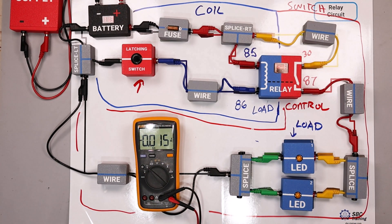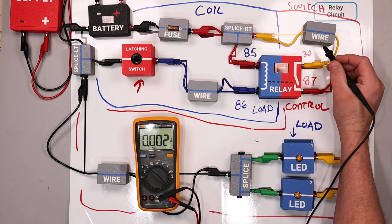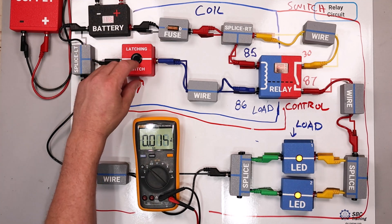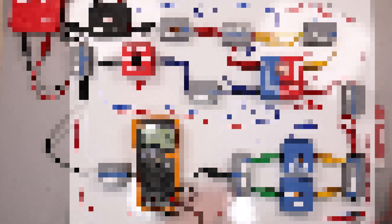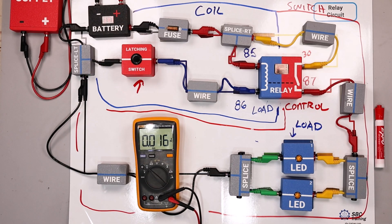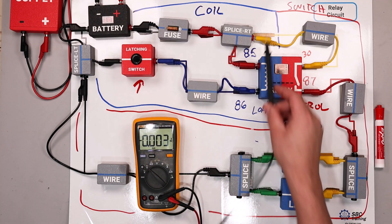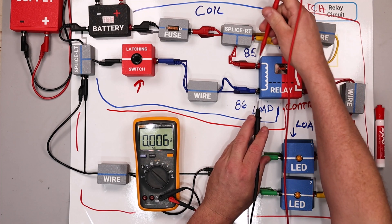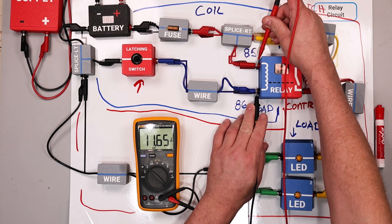For training purposes, that took about 10 seconds to fix. I kept everything running live so you could see how quickly you can set faults and take faults away. Pressing my switch now, I should see correct illumination of the LEDs. I'm turning off the camera so you don't know about the fault prior to testing. Trying to turn that on, we don't hear an audible click from the coil side, so that leads us to believe we need to stay concentrated in the coil area.